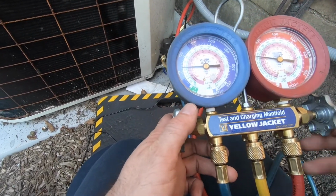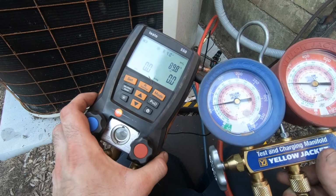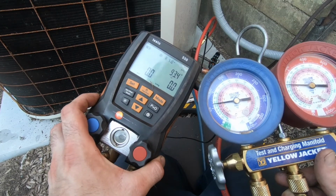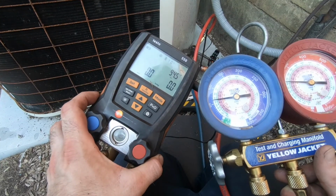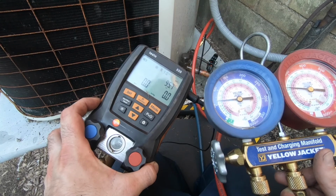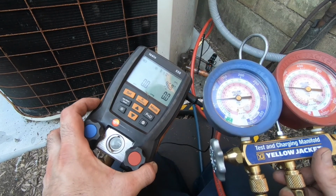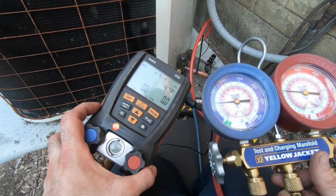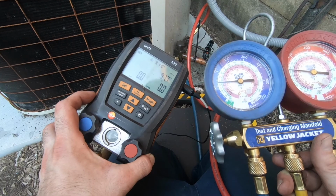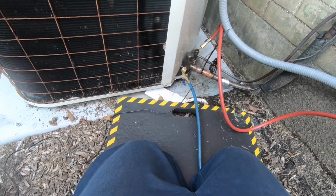I got a lot of water coming out the condensate pump. This is a piston system, there's no TXV in it. So the superheat is more important to me, the 14 degrees, than the 7 degrees of subcool. I'm happy with this unit. Thanks for watching, till next time.